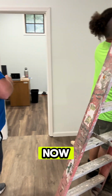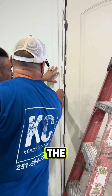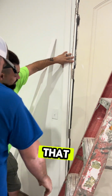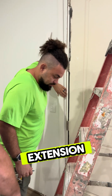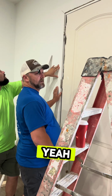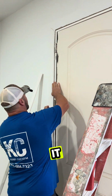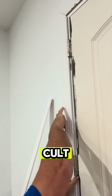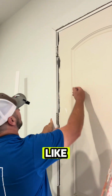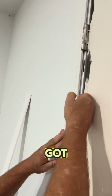All right, now let me ask you a question, Damon. See the way my sheetrock is? Pull your board off. See the way my sheetrock is a little bit out. What do you recommend doing in a situation like that? Something to fur it out. So would you do a jamb extension between it? In some situations, it's a lot greater than what it is here. Yeah, you can massage that sheetrock back right up against it so it lays flat. But it is going to cause you a caulk line out there on the outside. Now, we'll just fur it out and add a jamb extension. Zoom in right here, Chris. See the way I'm at my reveal mark right there, and then I've got this.